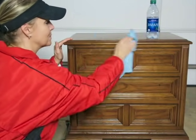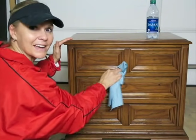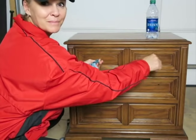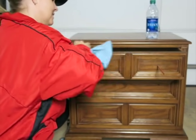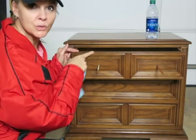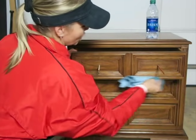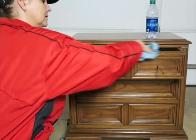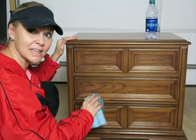It's a lot easier to do your prep work correctly from the beginning than it is to try to go back and correct your mistakes afterwards. I use my little paint brush handles to pull my drawers out, and then I clean the rim around the drawers — don't forget those because you're going to be painting them too, and you want your drawers to look nice when you open them.